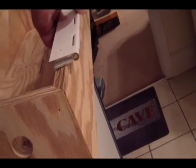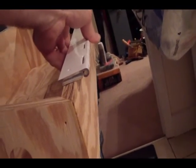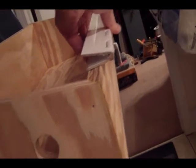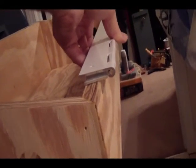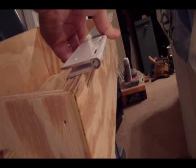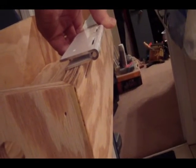But when it collapses down, you don't want to collapse it down all the way like that because the control panel top never would. It's actually going to be at a slight angle about like that to go with the angle of the side of the control panel box. But we need to at least make up for about that much to recess this hinge down so that the control panel top will sit flush. So that's about 3/8. That's what we've marked here.